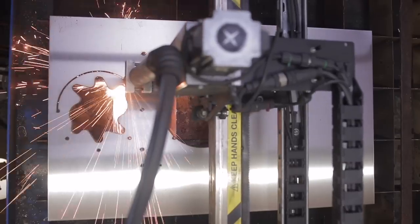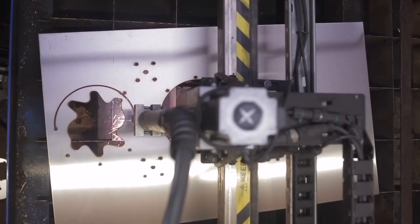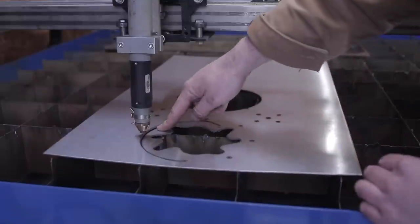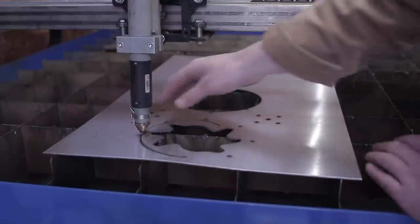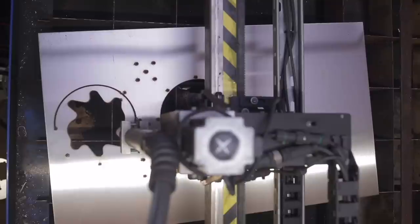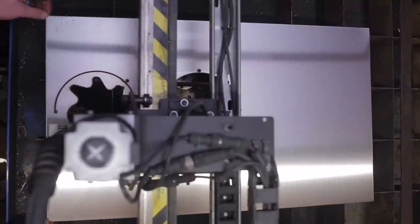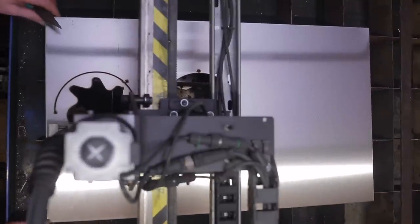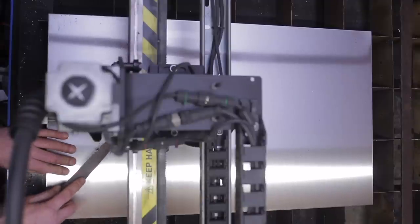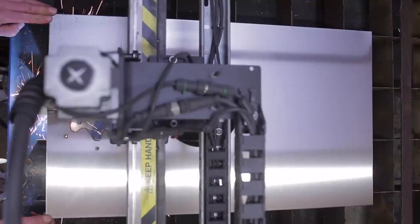Here's the snag. The stainless doesn't act like mild steel. When the sheet got warm enough, it warped and kicked up in a shallow bow. The machine torch caught it and started to drag it. Now the cool thing with the CNC machine is you can rewind and start from a specific point in a job. The tricky bit though is realigning the workpiece, and whereas it'll look like I got it fairly spot on, it was only close, and I ended up recutting the two big rims altogether.